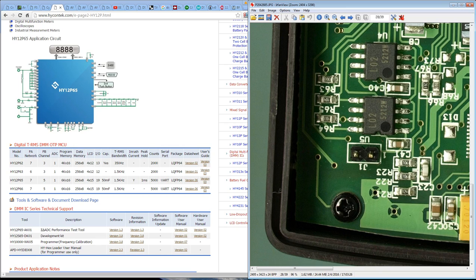In fact, bingo, it just occurred to me. Oh, hang on. Yes, the reason they're using two is for robustness, okay? They're doing this for physical protection, so that regardless of some bug in the software, you cannot erase the calibration settings of the meter. You've got to actually put that jumper on to enable the physical write pin of U5 here, the E² prom that contains the calibration data, whereas the other E² prom over here will be used for like the power on-off settings and things like that.